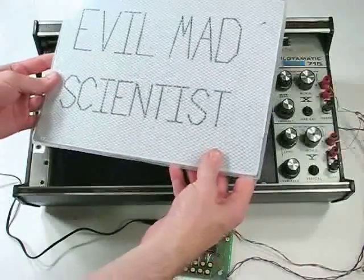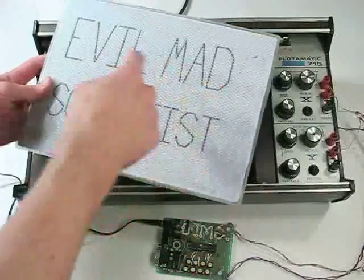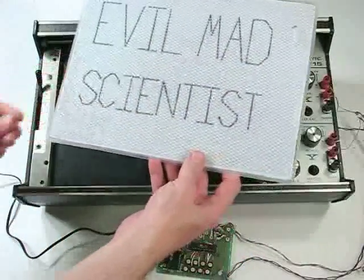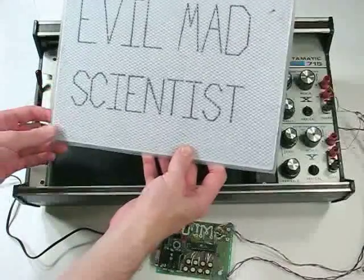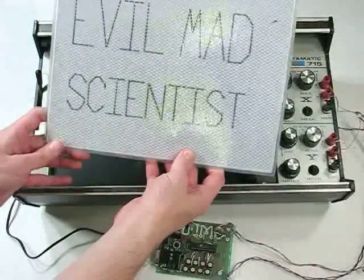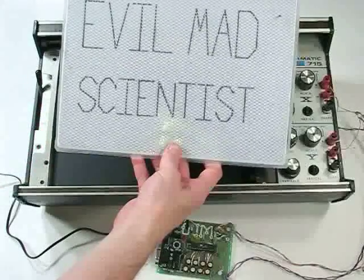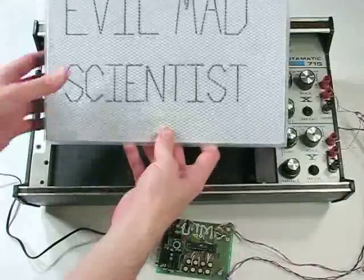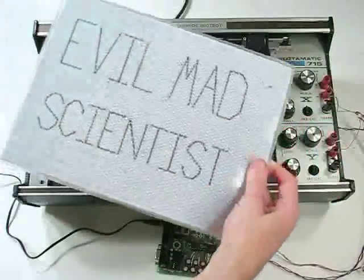This actually is not an electronic display per se, but it's a magnetic display because I used a magnet to draw these patterns on it. But it has all the hallmarks of genuine e-ink or e-paper technology. For example, it's very high contrast display. It reflects ambient light like a regular piece of paper does, so it's actually daylight readable. It's flexible, woo, and it's erasable.